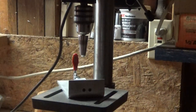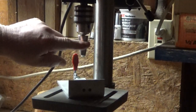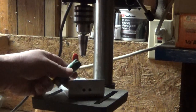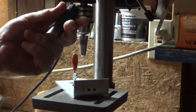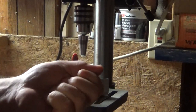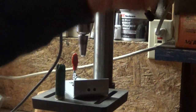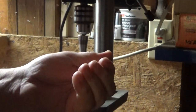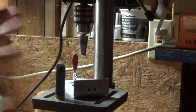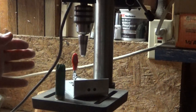So what I'm going to do is demonstrate that. First of all, no gloves. Anytime you use rotating machinery, never use gloves. There's a lot of guys too that will just go ahead and stick the hull on there with their hands. And I'll tell you what — if you ever had a hold of a rope and whatever was on the end of the rope cut loose and jerked the rope out of your hand, you're going to end up with a rope burn you wouldn't believe. That's something you need to take into consideration when working with friction here.